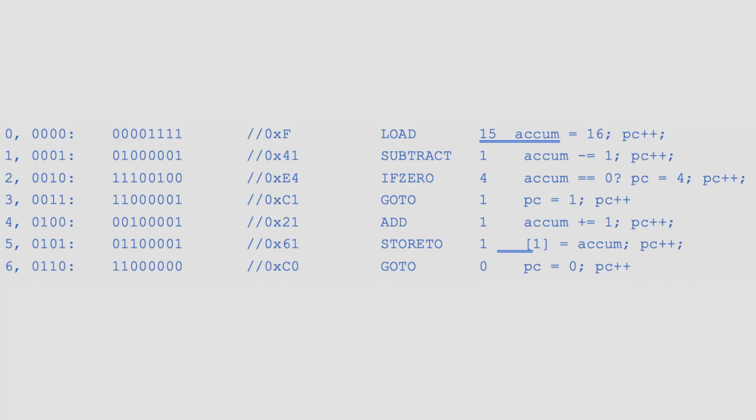The next instruction will check if the accumulator is 0, and if it is 0, then it will jump to the 5th instruction at address 4. Currently, the code that I just said is useless, as it will only ever be 14, not 0.